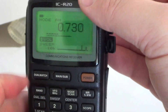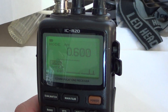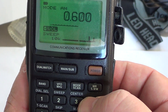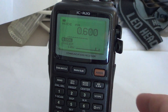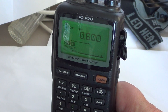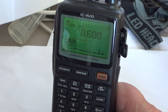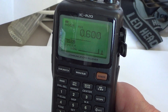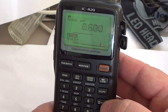This is how you find signals you've seen on the graphic display. You can also use the scope in continuous mode by pressing and holding the scope button until it beeps — then it scans all the time. One drawback: the scope gives you very quick audio but mutes it, so you won't hear any stations, just see the spikes. You can't really listen while using the scope, but it's useful to see what signals are around your center frequency.